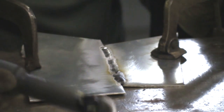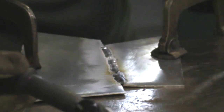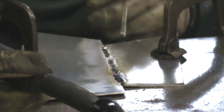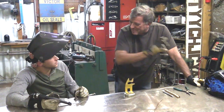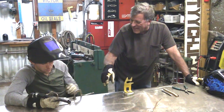A little bit smoother, but a hot start. What do you mean by hot start? Right here where I started the arc — it was pretty warm compared to the lower pulse pass back there. Okay, so just for giggles let's go ahead and max out the pulse — 200 a second — and run another bead alongside it just to see what it looks like.